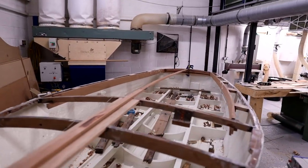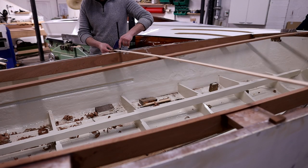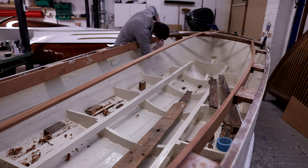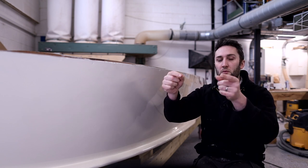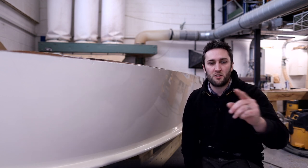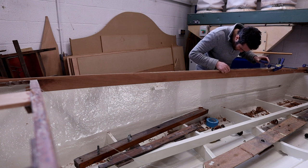Then we're on to shaping the carlins. What I wanted was a nice shape back into the deck, so I've run a central batten that creates my arc from the stem through all the deck beams right down to the beam across the transom — a nice fair curve across all of those. From that I take a curve running from the center of the deck line down into the top of the shear line either side. I run a little batten sideways across the main central one, raised up by the thickness of the central batten, then mark it back down to the correct height using a piece of timber the same thickness. That gives me my line to work to on the carlins at various stations, which I join up lengthways to give me a mark to trim the carlins down to — creating a slightly cambered, fair deck.